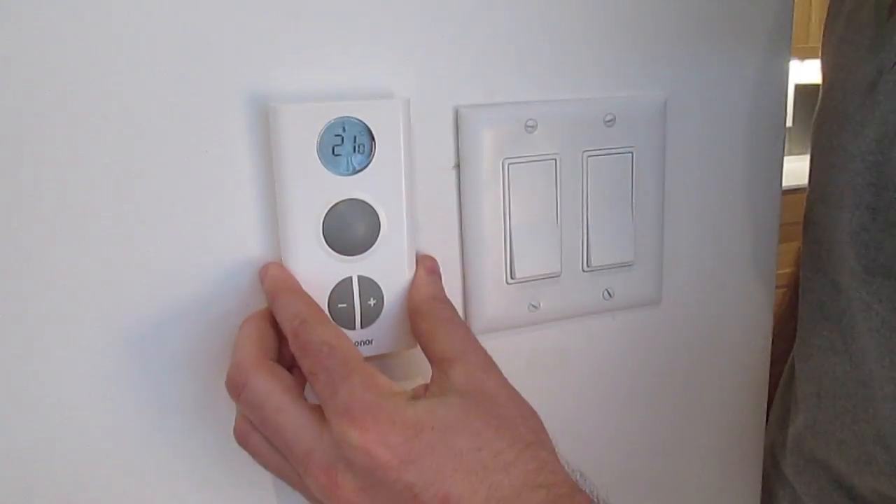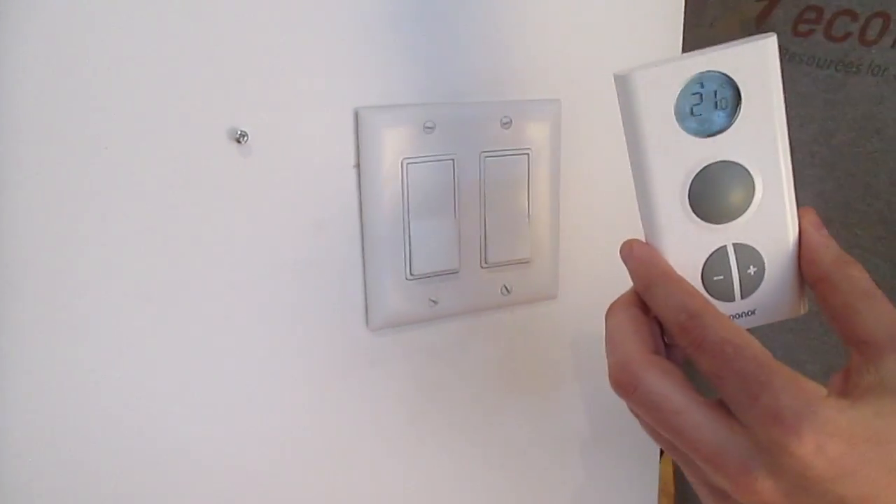It's a really simple installation — you can work with different temperatures in different zones of the home. In our case, we don't run water through the south side and we're usually only heating the northern parts of the home as well as bathrooms. The thermostats are also programmable, and we didn't have to wire low-voltage wire during the rough-in — it all works wirelessly. So we can guarantee comfort for everyone in the home.